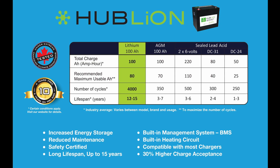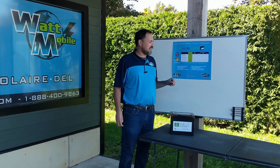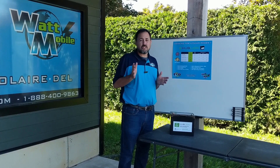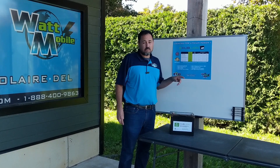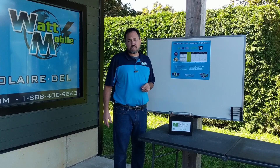In a 100 amp hour lithium battery, you almost have the same as two 6-volt batteries, but the lithium battery is made for 4,000 cycles. That's one cycle a day — 11 years. So the battery is good for at least 11 years, probably 12 to 15. And in your unit, you usually use it for three, four, maybe five months during the year. So that's more than two to three times what we see with two 6-volt batteries.